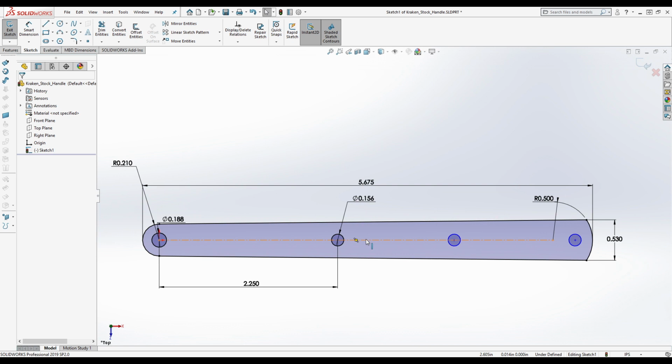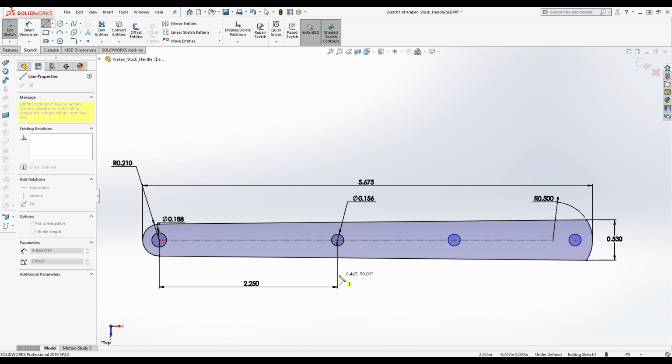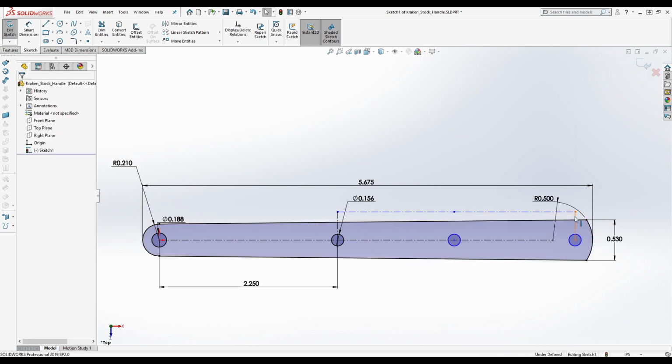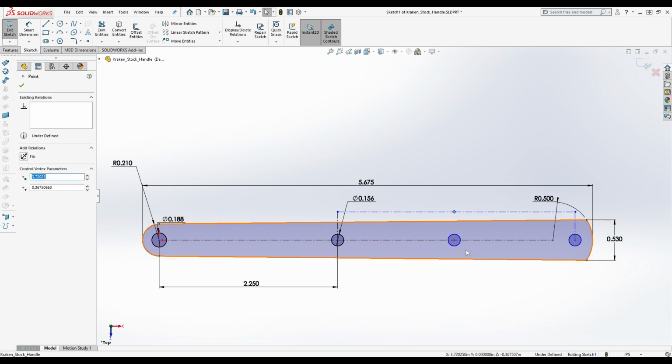I don't know that I want to. Okay, so there's other ways to do this, but I'm going to do this kind of the simple way, so people can see what we're doing here, okay? So we're going to go up here, and we're going to put something here. We're going to put something here. We're going to put something here, okay? Now this, we're going to constrain to be vertical, okay? This is more for the purpose of illustrating. You can use dimensions as variables in CAD software like this, which is the right way to go about doing this, or you can draw two lines and make them equal, but that's what we're going to be doing here basically.